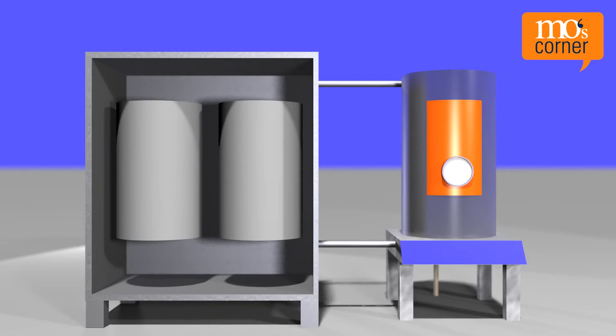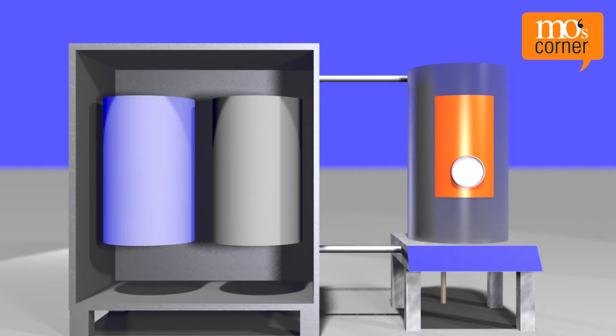In principle, the dry air dryer works by pre-dried air transferring the humidity from the plastic to a molecular sieve — a special desiccant. The molecular sieve can be regenerated by baking out: the moisture absorbed by it is removed again by heating, meaning it can be used again and again.